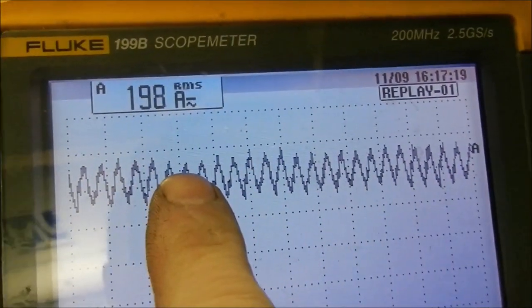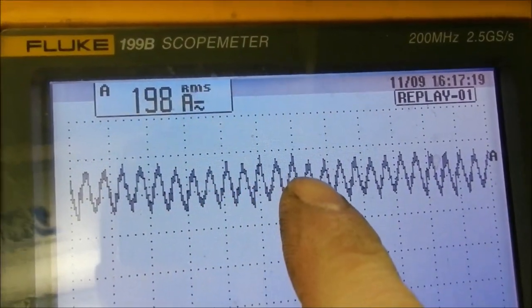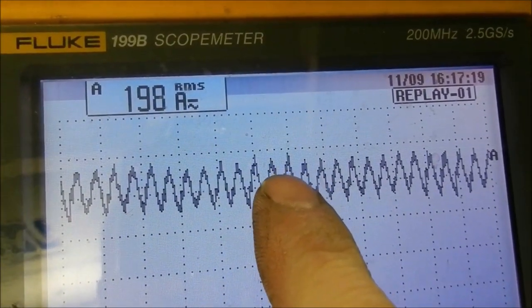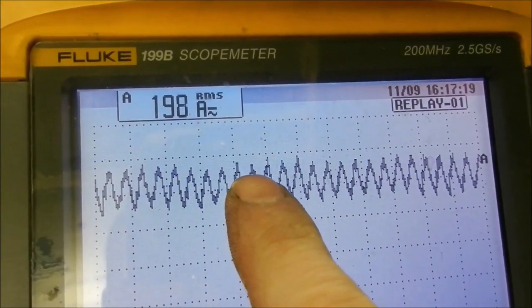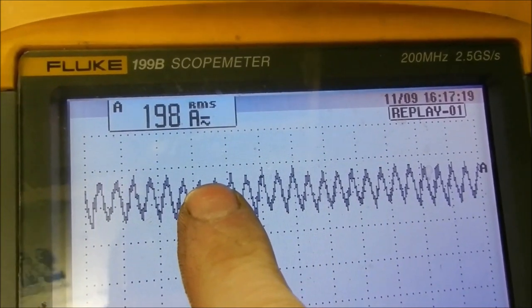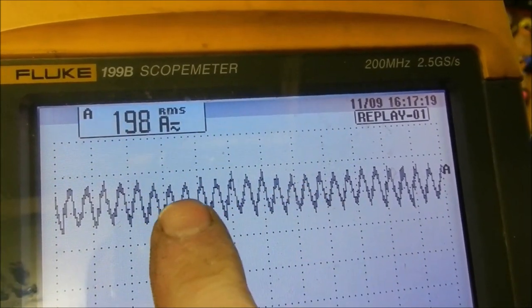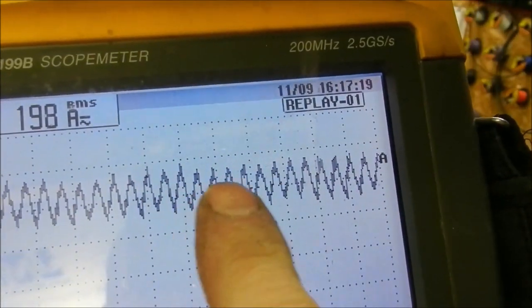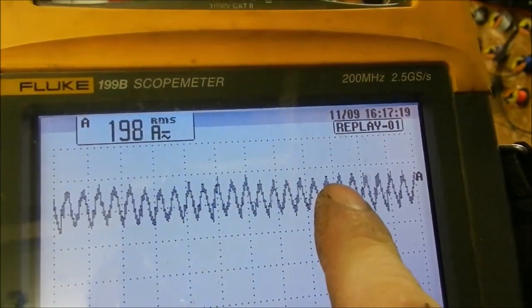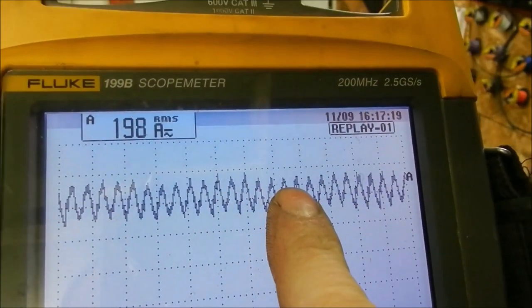Let's pick the lowest one — the other lowest one is right there. So we count: 1, 2, 3, 4, 5, 6, 7 in between. It must have picked up a little compression later because there are 7 in between. That pattern will continue, and if there was something uneven — say one cylinder had low compression — we are going to see that. I will go ahead and pull a plug to show you that.